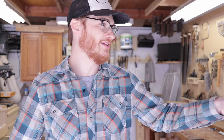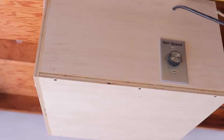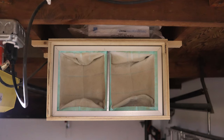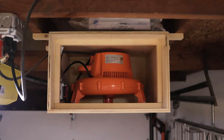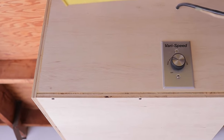One last thing I want to mention is the air cleaner in the shop. I have the stereotypical 20-by-20 furnace filter taped to a box fan. Usually if I'm just out here I'll leave that on all the time. But when I'm cutting a lot — ripping on the table saw, creating a lot of dust — I'll also turn on a dedicated air cleaner I built. It's a box that accepts purpose-built shop air cleaner filters, and inside there's actually just an orange plastic impeller motor meant for blowing up bouncy houses. It moves a ton of air but it's also pretty loud, so I'll turn it on while ripping and turn it off again when I want it quieter.